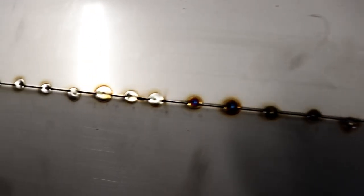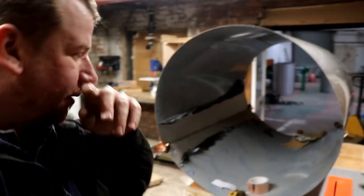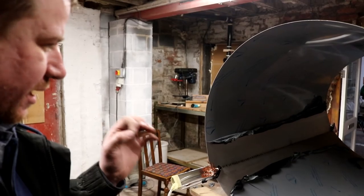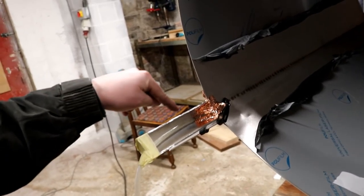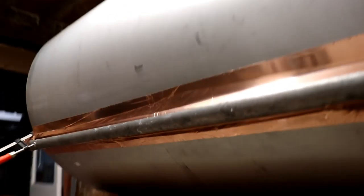I've managed to tack up all of the tanks. I've got one of them hoisted up onto the workbench and I'm going to try and weld it from the inside out. To prevent any sugaring or carbon build-up — oxidation — on the outside, I've put that half-round scaffold pole that I cut on the back there, clamped and taped all the way across to provide an airtight, gas-tight seal top and bottom.